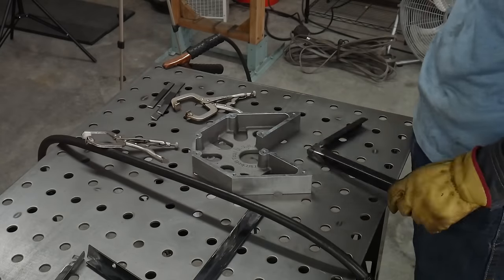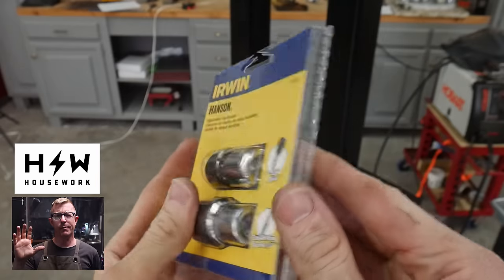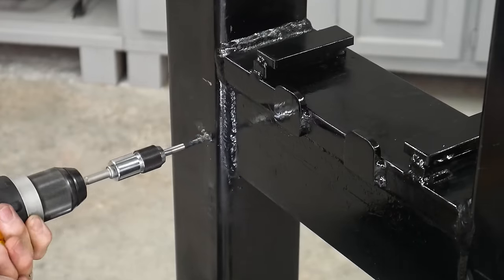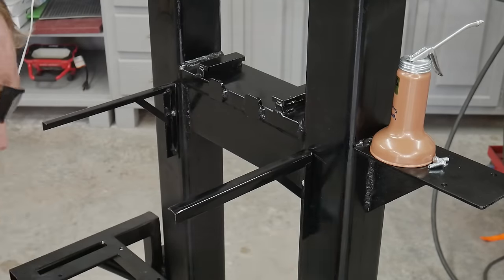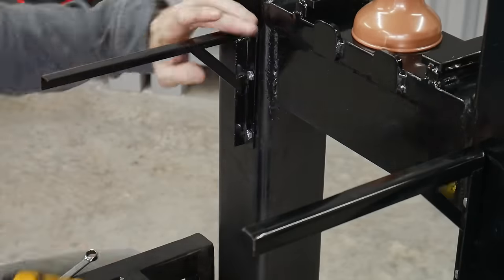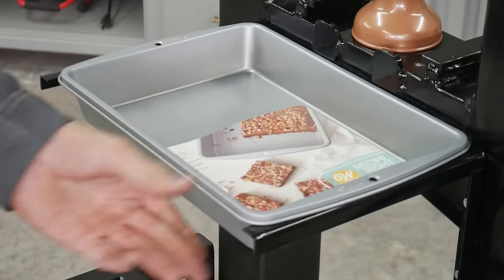Next I'm making a slag catcher for the back to cover the motor and pump using some old angle iron. I got the tap holder idea from Houseworks - it lets you put a tap in your drill and greatly speeds up tapping holes. I'm tapping quarter-20 holes to bolt these brackets onto the back of the press rather than welding them, in case I want to move them later. I'm using a 13-by-9-by-2-inch deep baking pan to catch the slag.